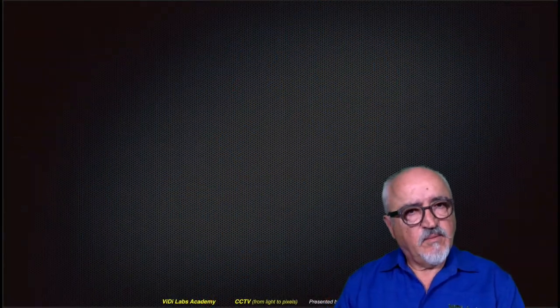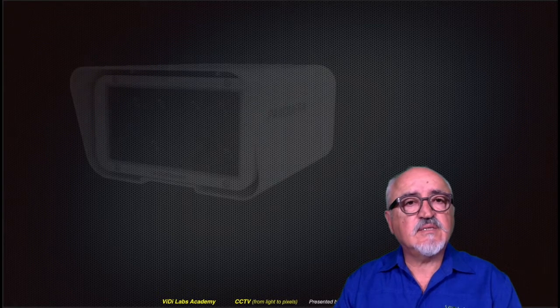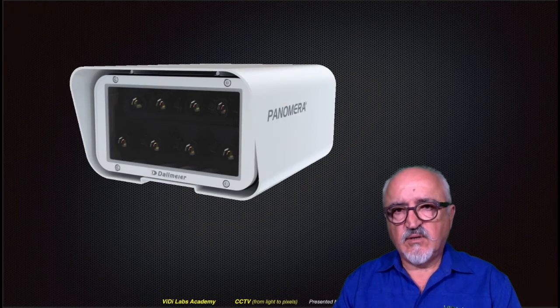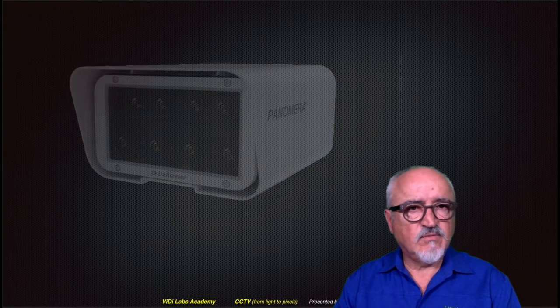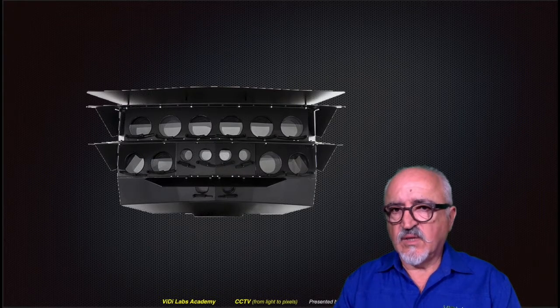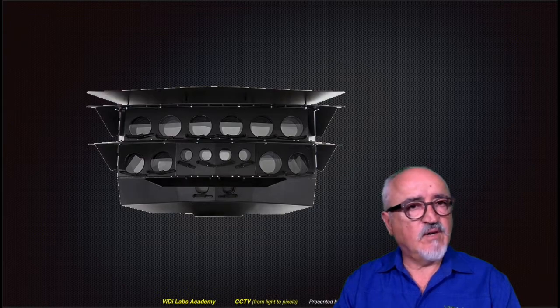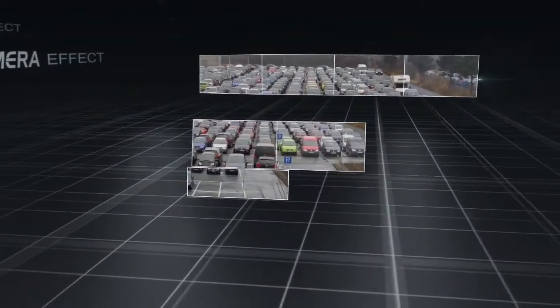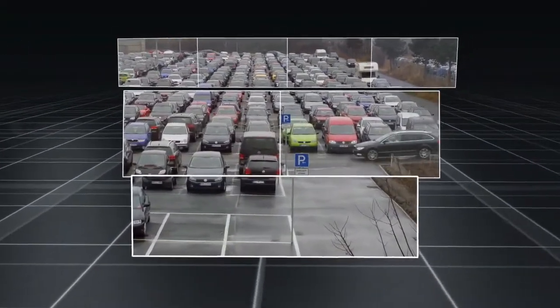Another special camera design with the similar concept of live video stitching, whereby all cameras and lenses are pointed in a particular direction rather than the all around 360 degrees, is the multi-sensor and multifocal panoramic type of camera, producing live video assembled of multiple HD, 4K or megapixel cameras installed in one housing, with a high quality live video stitching at 25 frames per second. Such panoramic cameras are primarily intended for viewing large scenes at longer distances.